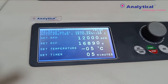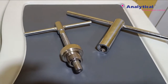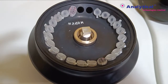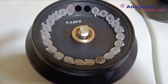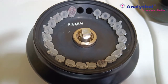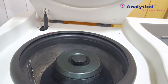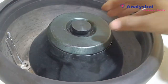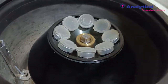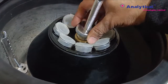Now the centrifuge has stopped. Here are some accessories for rotor installation. This is the second rotor head — 1.5 ml x24 — with a maximum speed of 20,000 rpm. For installation of the rotor, you can remove this collar and remove this nut using the box spanner. Then open the rotor using this panel.